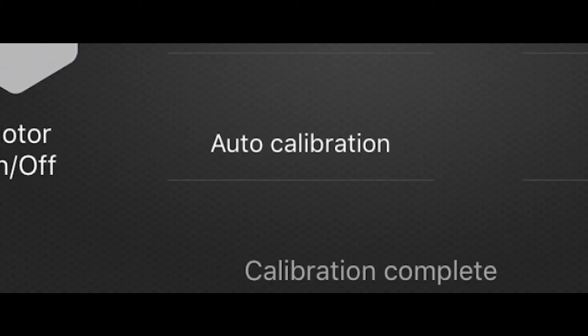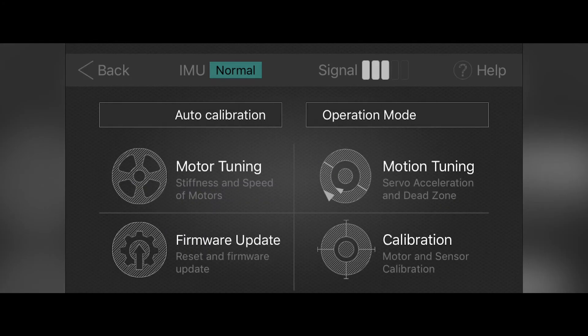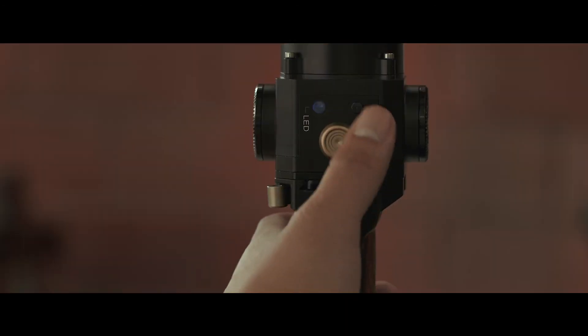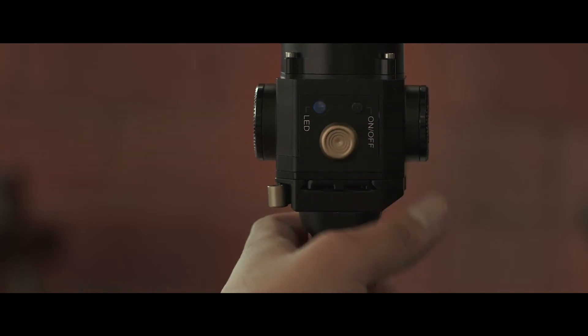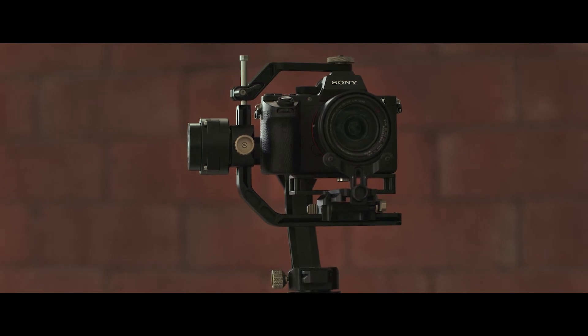A good reason for doing this is to optimize the stiffness for each of your motors — you have to do this first before you can start setting up auto calibration. A reason why you would want to auto calibrate is if you are holding the gimbal in a certain position and you start feeling or hearing vibration coming from the gimbal. You would go back into your home page and press auto calibration while holding the gimbal in that position, or press the on/off button three times. Hold in that position for 15 to 20 seconds — you should feel the gimbal calibrating, and after that the vibration is eliminated.